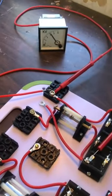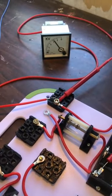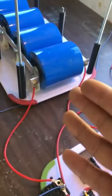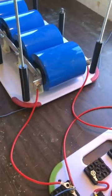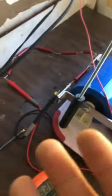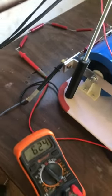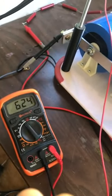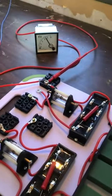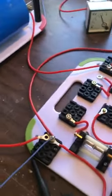It seems to stabilize at about 7,000 volts at pretty minor 20 watts. This acts as a battery or storage device for high voltage, and that is being reduced through the voltage divider — which could probably be done a bunch of different ways — giving us a DC 630 volts output, constant, holding at 7 kV.